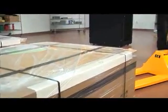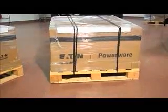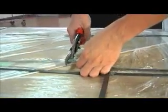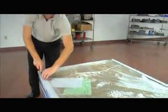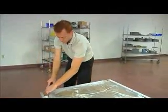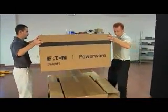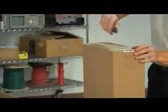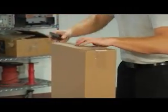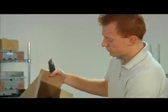Now that the rack is in place, move the box that contains the UPS nearby. Use snippers to cut the shipping straps, and the box cutter to cut the plastic along the corner boards. Cutting along the corner boards will ensure that you don't damage any materials. Once you pull the top off the box, you'll find, what else? More boxes. Some are intentionally left empty to protect components during shipping. Don't worry, we didn't forget anything. Open every box to make sure you don't discard anything you need.